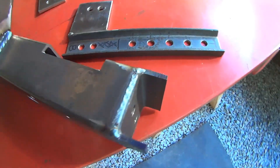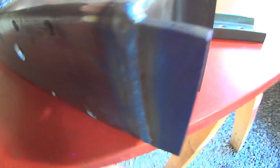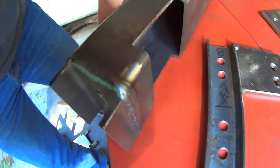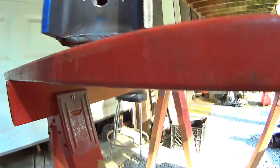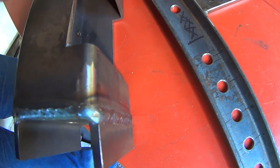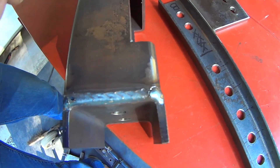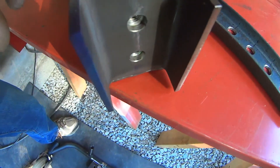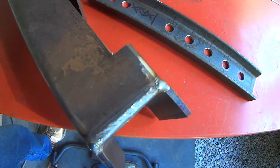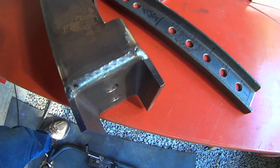You can see all the way around these caps is welded. This side I wire brushed it — top, right, and bottom. That's welded all the way around. What I'm pointing out is that at the corners there's overlap — it's welded all the way around, it doesn't stop and create a stress riser in the middle of the joint where you're going to create a crack possibly. So all the way around the tubes is welded.